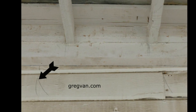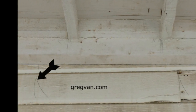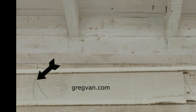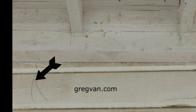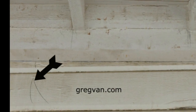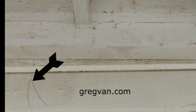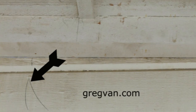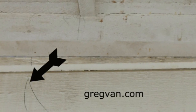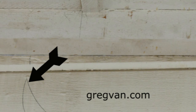You can see where it looks like they painted the lumber — this could be a primer. It looks close to the original paint, but the pencil marks are a dead giveaway that there's a problem and they should paint them. I need to stress this: I have seen pencil marks bleed right through white paint. Don't go too heavy on pencil marks — a nice light pencil mark you can paint right over, but I have run across situations where they were difficult to get rid of, especially with white paint.